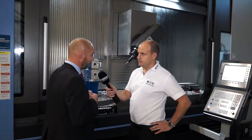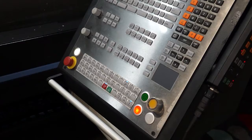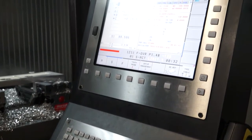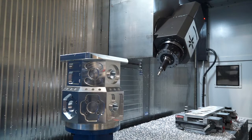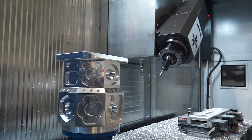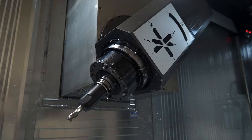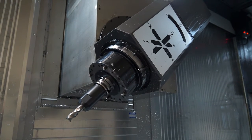Is this a three-plus-two, or four-plus-one, or a full five-axis? This actual version is a full contouring five-axis machine. It has the Heidenhain 530 control system. But you could have the machine as a three-plus-two with an entry-level Fanuc control system if you want to get the cost down. This particular model and where I see our market is four- or five-axis. And if I wanted to use that head to do negative-angle drilling, can you achieve that? Of course — this is 220 degrees of movement, 30 degrees past 180 in both directions, so negative 30 degrees either direction is achievable.